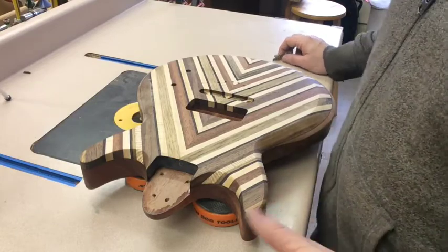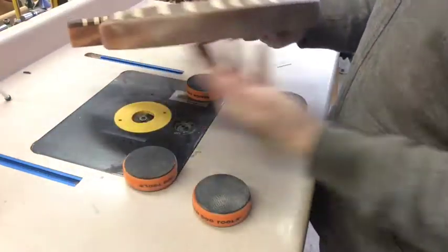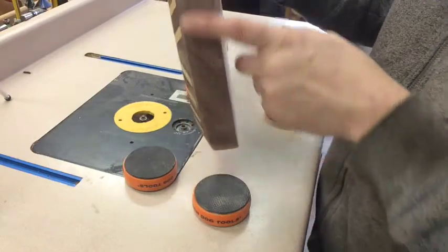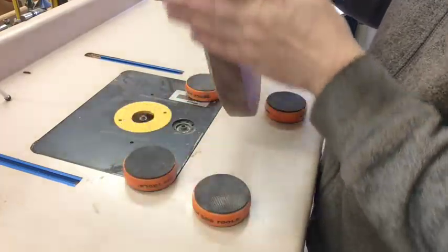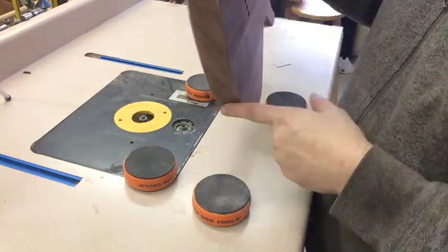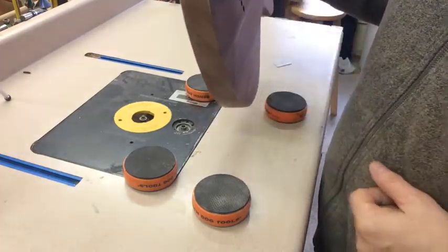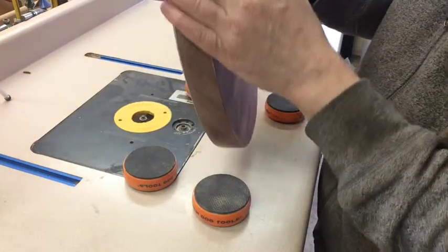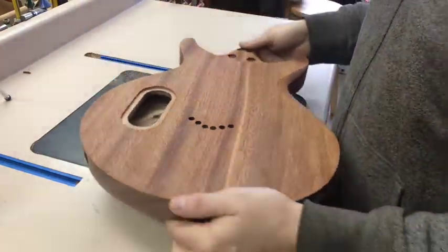Fortunately I didn't find a whole lot. I found a minimal one in here that I can't even tell if it's a scratch or not, but I did find a few on the tail end here. I've already gone and sanded those out using a mouse sander — those triangular vibrating sanders stay nice and flat and do a really good job getting out scratches on end grain. So I'll need to hit that area first when I do my next coat.